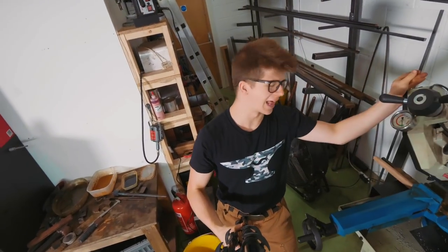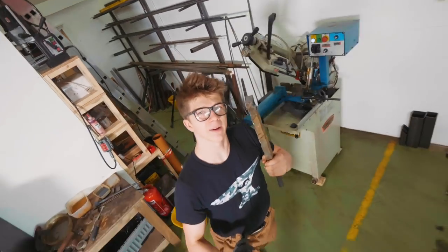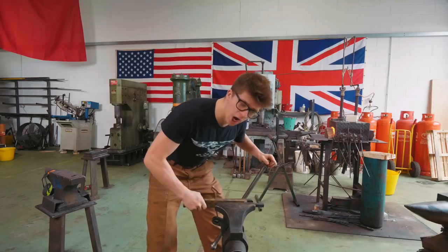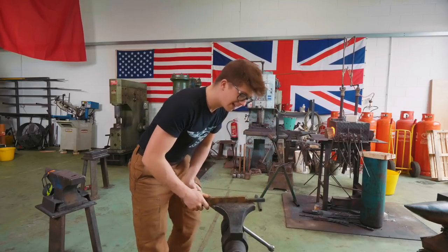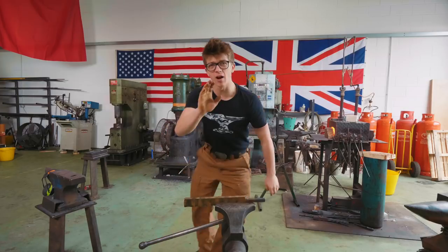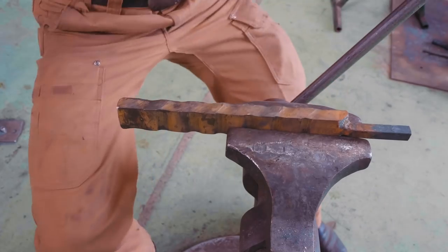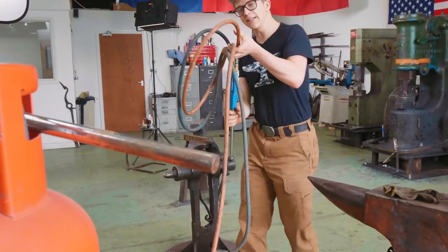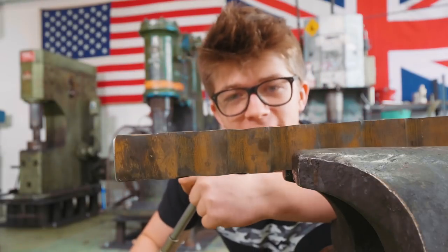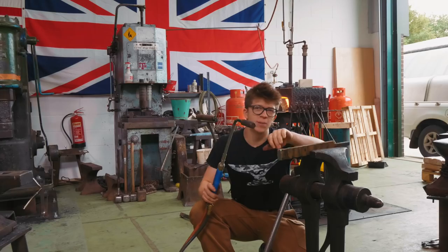Now I know what you're thinking, Alec, you haven't particularly explained why it is that you took a slice off that nice billet of Damascus. Well, the reason's as follows. That guard, or the bolster, whatever you want to call it, that integral guard, integral bolster, is gonna need a little more mass than we currently have in the bar. So indeed, the first step is locking this puppy in the vise as hard as I physically can. And what I'll do is take my oxy-propane heating set, and with this we're gonna take an isolated heat in this area here, and we're gonna upset some material into it.